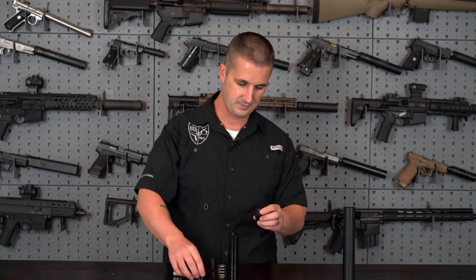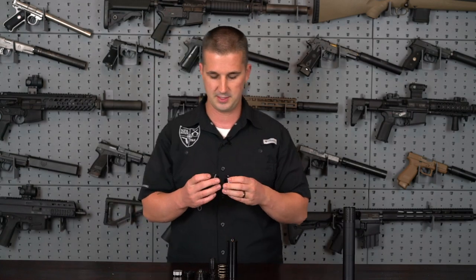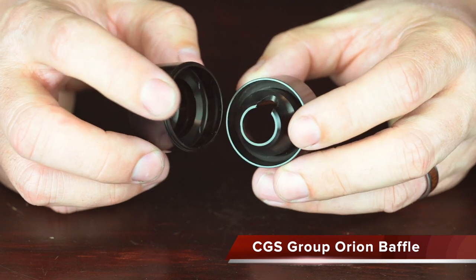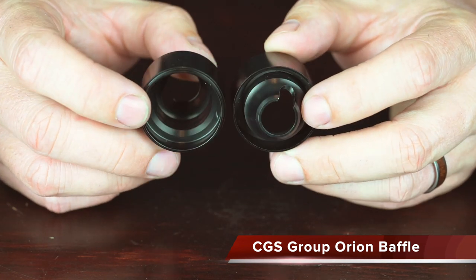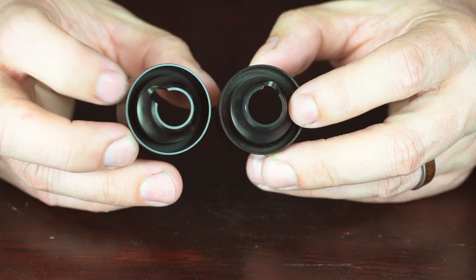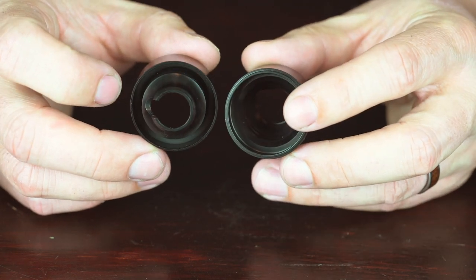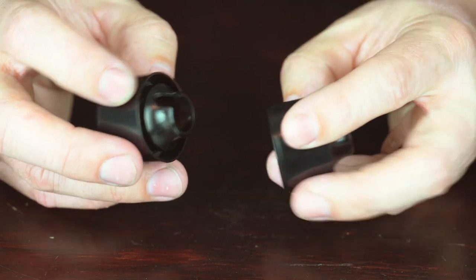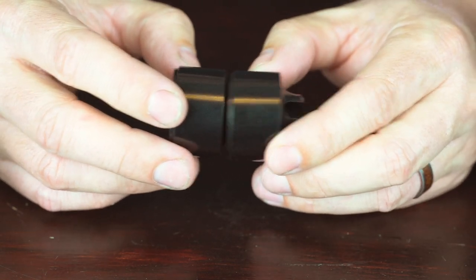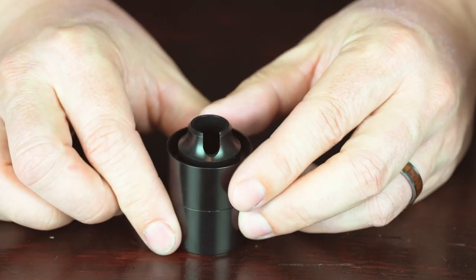So if you guys have been paying attention any length of time to my channel, you've seen some reviews I've done with CGS Group, you know that this is called their Orion baffle. What it essentially is, is a captive system here. So once the stack is assembled, you have an outer tube assembled. So what that's going to do is, in between these lips, it's going to trap all the carbon and gas within the baffle stack assembly, making disassembly from this tube a lot easier later down the road when you have a lot of rounds on it before taking it apart.